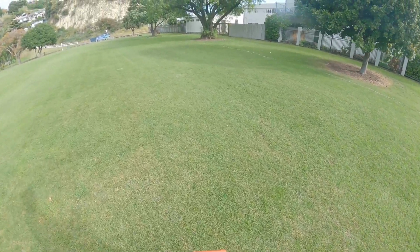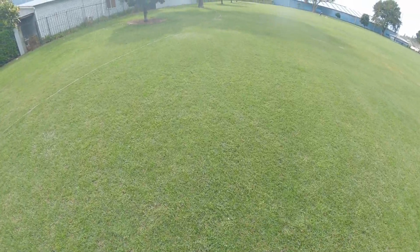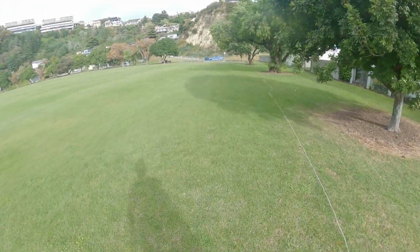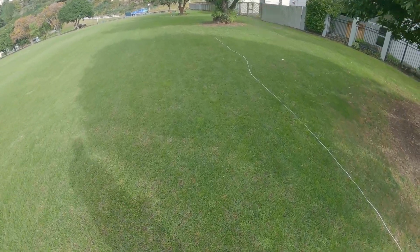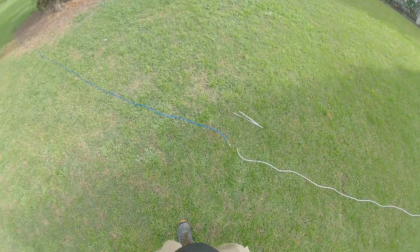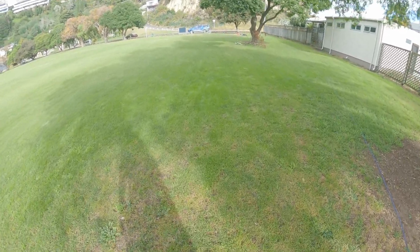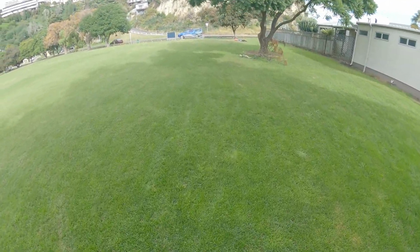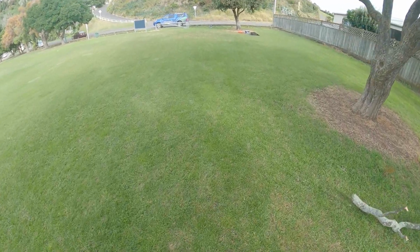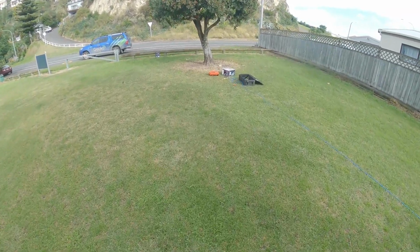So if I come across this way, it's getting stronger as I get closer to it, so it's just emanating through the air. It's not actually jumping onto the cable. I will admit that is now 5 centimeters apart. So my testing of individual distances is probably not really going to work too well, I don't think, because for an underground break, we really need it to jump at least that distance, I think.